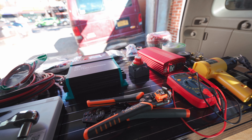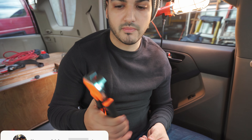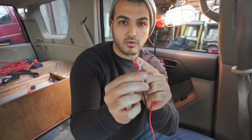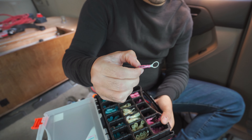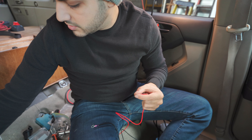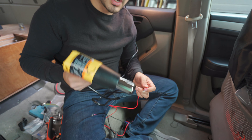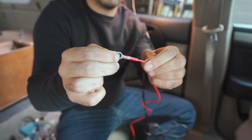I'm going to show you just the basics of what I'll be doing during this whole process, which is making connections. You're going to need a wire stripper and a crimper because you have to cut the wires and put a specific size of ring connectors based on what your battery is. One of these sets will tell you what gauge wire and which connector you'll probably need. I'm going to cut this wire, strip it, twist it, put it in the connector, grab the crimper and squeeze. Then you can use a lighter, but we got a really cheap ten dollar heat gun. And now we have a connection.